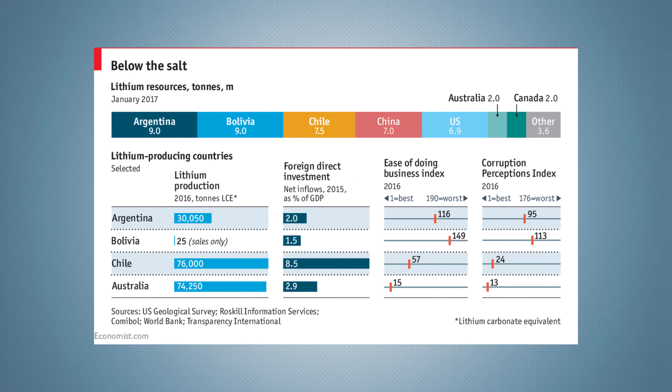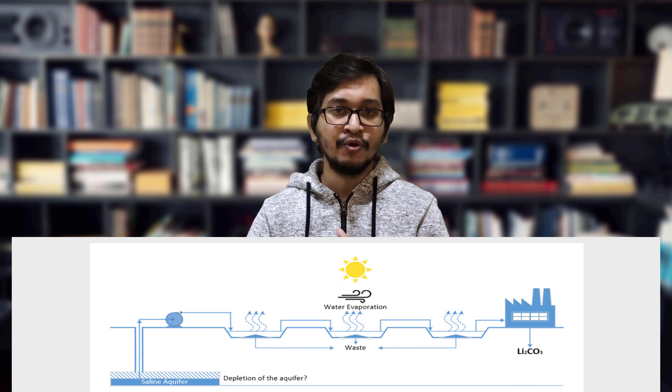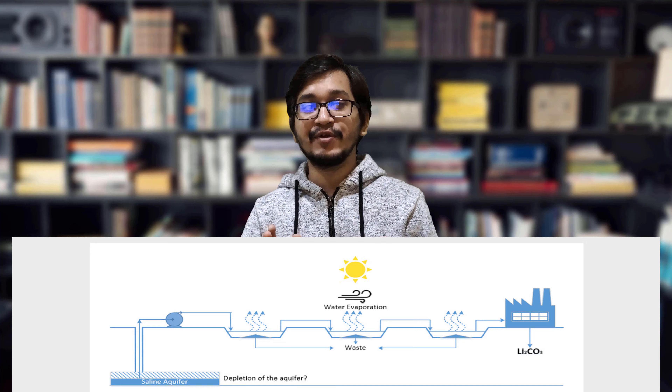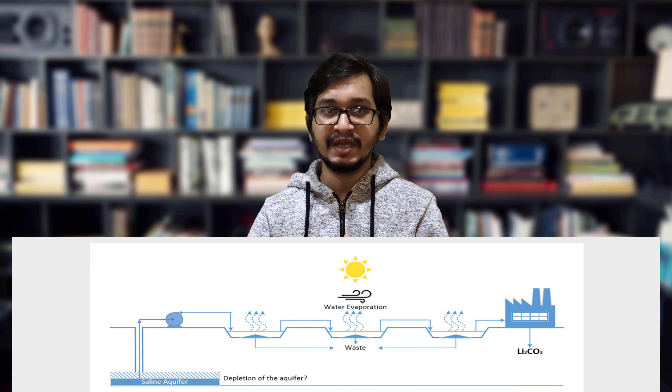First, the conventional lithium brine extraction process. A large quantity of lithium is extracted from lithium brine reservoirs located beneath salt flats known as salars — most of which are in southwestern South America and China. Other lithium-rich brine resources include geothermal and oil-field brines. Lithium brine recovery is typically a straightforward but lengthy process, taking anywhere from several months to a few years.